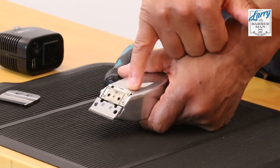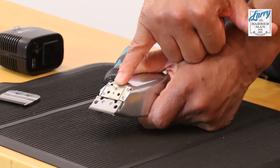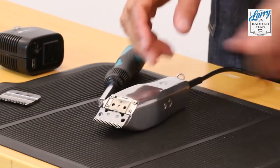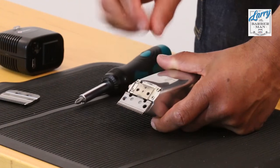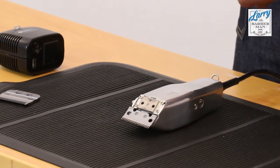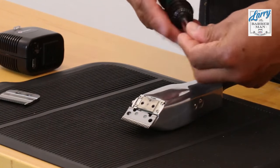You've got four screws over the top here. These are called the screws for the blade pad. What alters the tension is just adjusting these screws. If it's too tight, just loosen the screws slightly and you'll find that the pressure adjusts accordingly on the actual lever itself. I'm just changing screwdriver heads to something slightly smaller because the screws on here come up quite small.